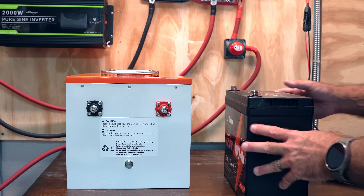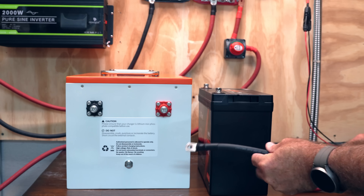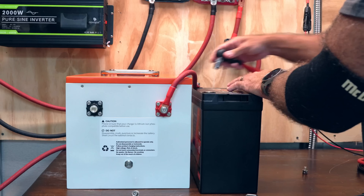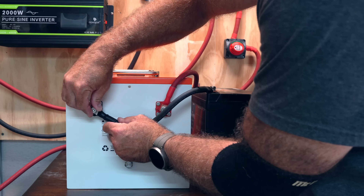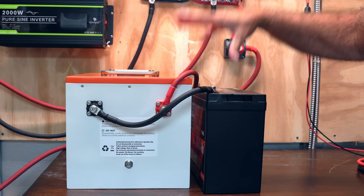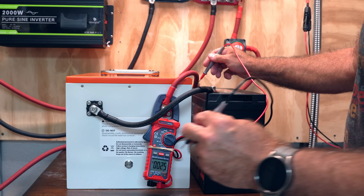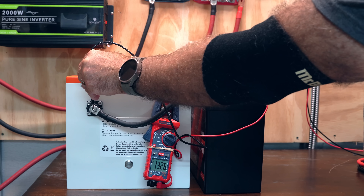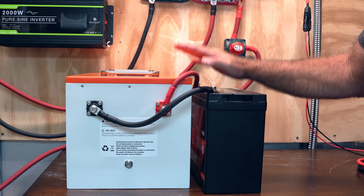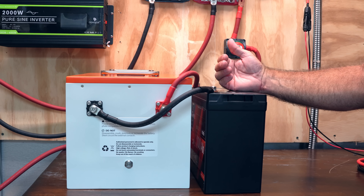To make our parallel connection, I'm going to try to keep these as close together as we can. I've got a couple of cables here for a positive and a negative connection. I'm going to hook the positive to the positive and the negative to the negative. First, let's do the positive. Now I'm not torquing these down all the way just yet because I do have to make the connection from the batteries up to the bus bar to power the inverter. Let's go ahead and check the voltage from the positive of this one to the negative of this one — we are getting 13.26 volts. Before we make the battery connection, I'm going to let these equalize for a little while, then hook up the 12-volt charger to make sure these are fully charged and topped off for a fair representation of the combined total watt hour output.